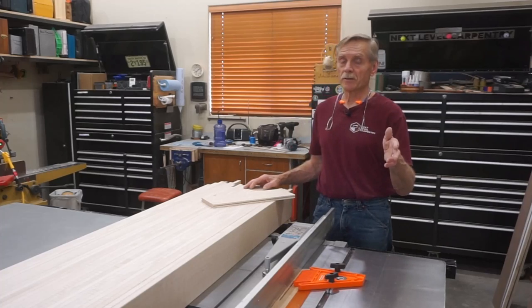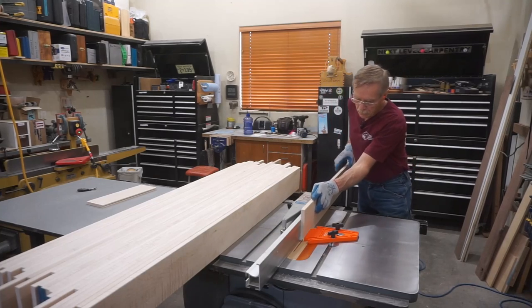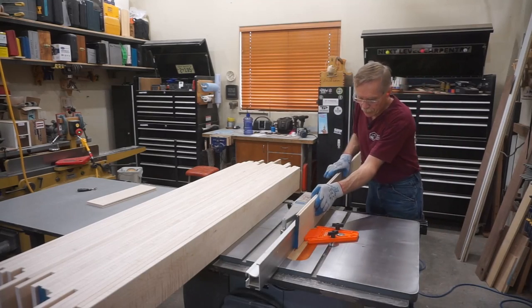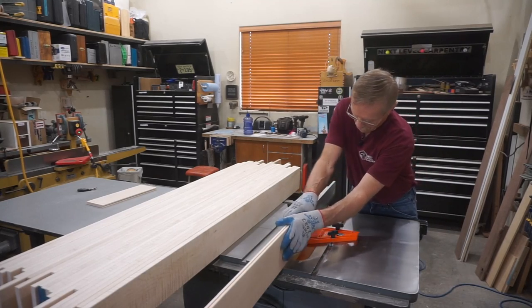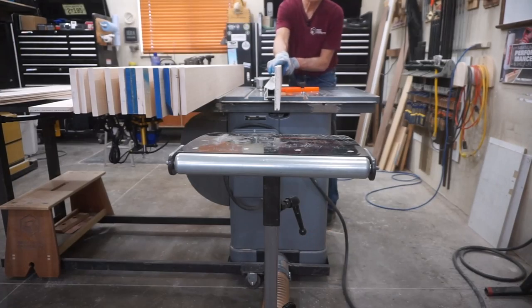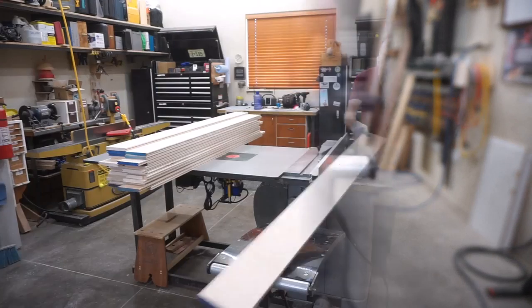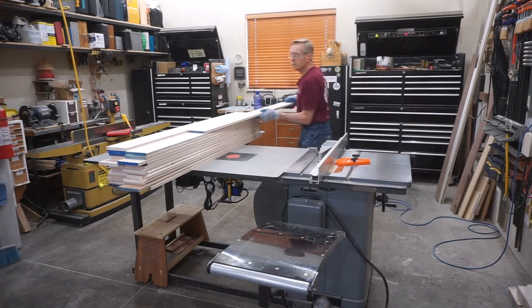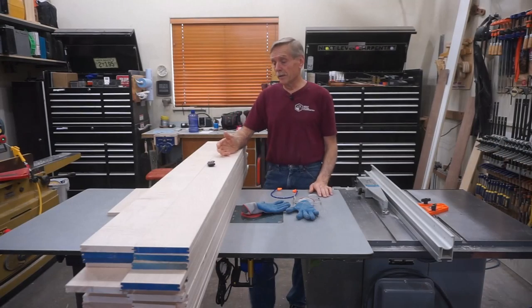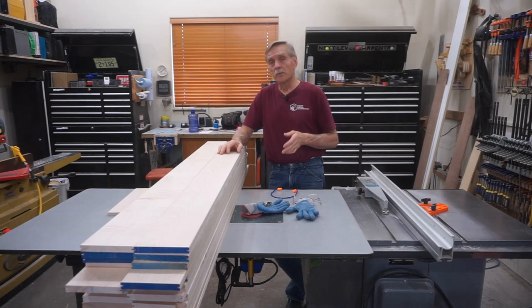As a quick overview: these pieces are five eighths of an inch thick, the groove is spaced a quarter inch from the back of the piece, it's an eighth inch groove, and that leaves a quarter inch from the groove to the face. Those dimensions can vary from project to project depending on the design. I made a prototype with this exact setup that the designer and client liked, so that's how I got to the profile and dimensions you see here — and now I can get to work running these grooves.